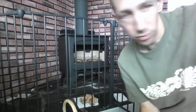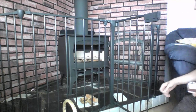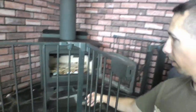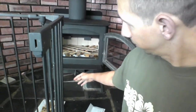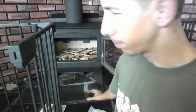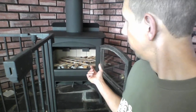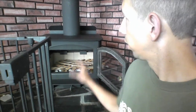We're going to try this thing out. It also says in the instructions to keep the damper — the airflow thing — all the way in. More air pushed all the way in, less air the more you pull it out. It also warned that you want to keep the door open slightly so that it doesn't stick to the paint when you go through the first initial curing process. So we're going to go ahead and see if we can actually start a fire.